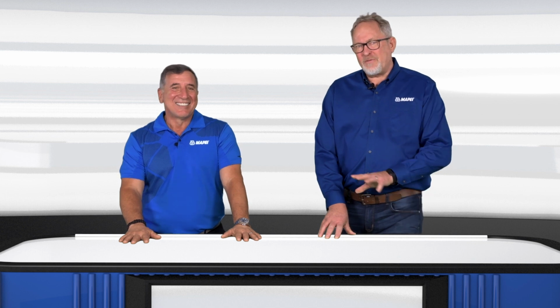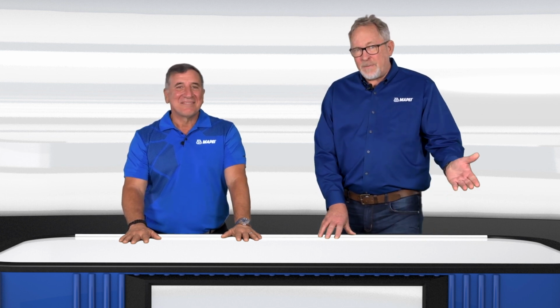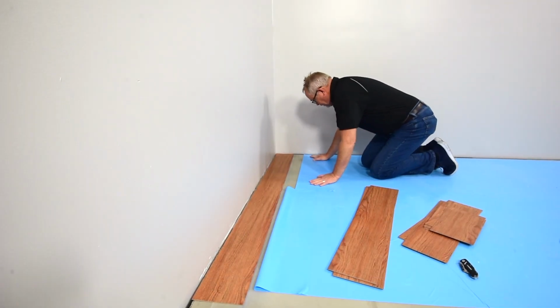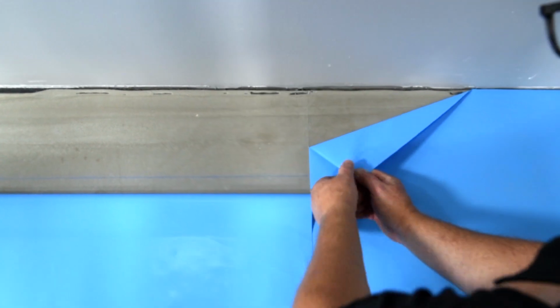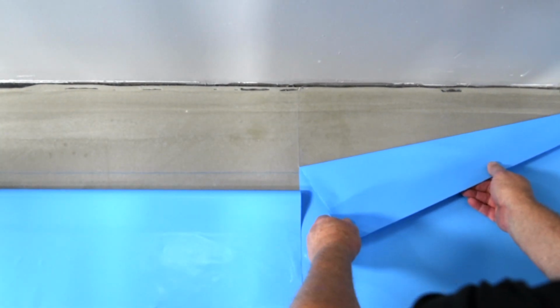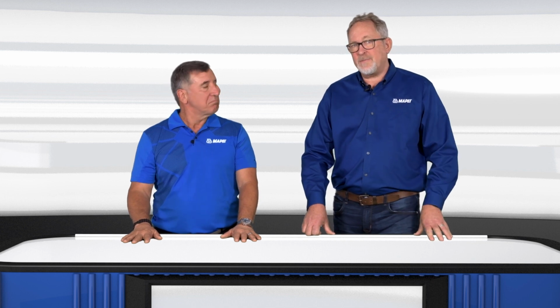Sure. Installation of most flooring is pretty straightforward with either MAPEI Contact MRT or SRT. Simply pull back the release liner and install flooring into the open tape surface. MRT is clear, by the way, so you can put your layout lines on the floor first, cover with MRT, and when you peel back the release liner, you can see your layout lines.